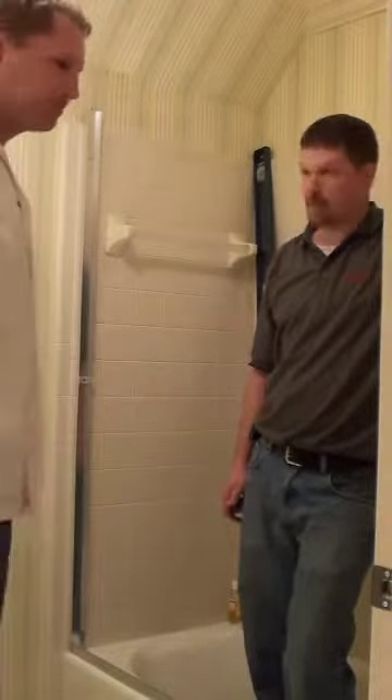When you order semi-frameless units from us, we put a towel bar on the outside but we do not automatically put them on the inside, because if somebody was to fall in the shower and grab hold of that towel bar, it's going to pull that glass down on top of them. On our framed door, since the towel bar is drilled through the metal frame, we do put them on the inside because we feel it will just strip the screw out. But on glass, when you're through the glass or even compression-mounted onto the glass, we do not supply it as a standard. If your customer requests a towel bar on the inside, we will supply it, but generally we'll make you sign a waiver form saying Cardinal is not responsible if that customer slips and grabs it and breaks the glass on top of them.